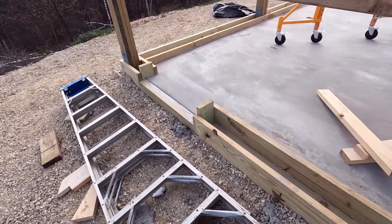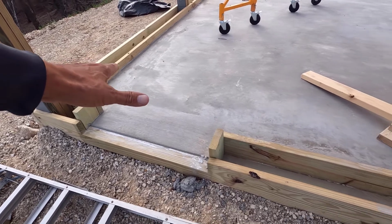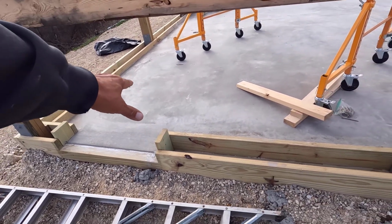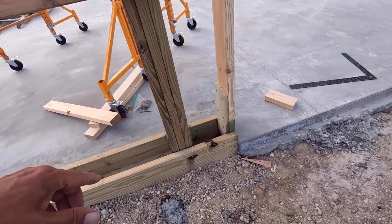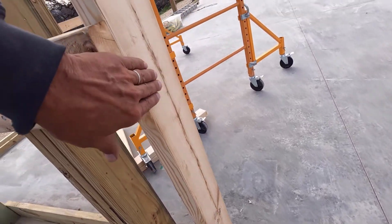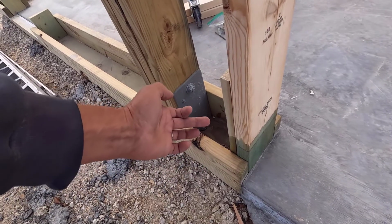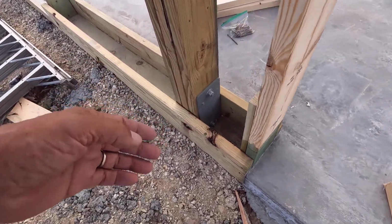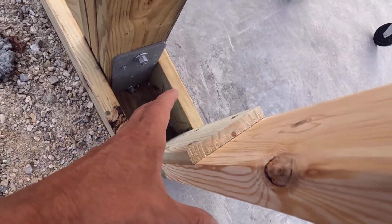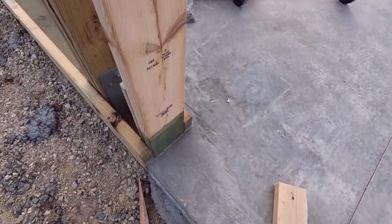So how I've been doing that is I take out these temporary boards, and I believe they're about 8 inches. So what I do is cut a new board for that and pocket screw it and connect it to a standard lumber board. I connect it with pocket screws on the back side, no glue or anything. And then once it's connected nice and tight like that, I add this splice board to the back. That makes it incredibly strong.